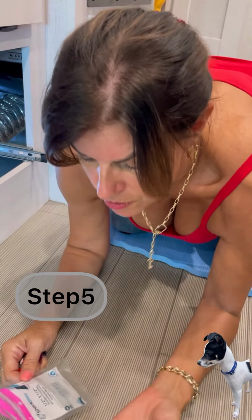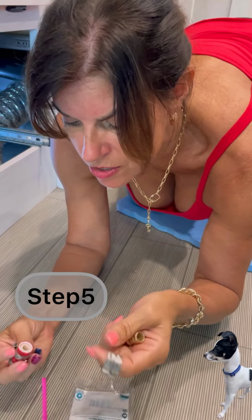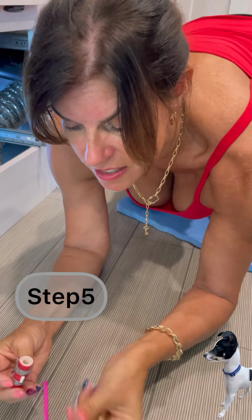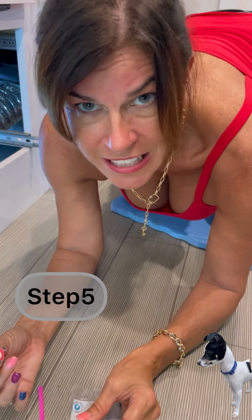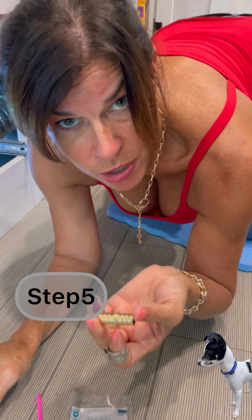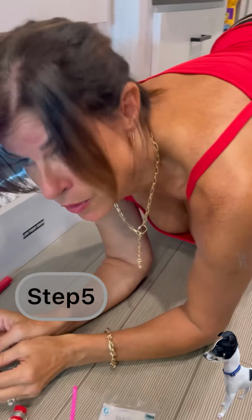So I'm going to use a genuine Shark Bite metal coupling, and they use the shoddy plastic coupling here, and it did not snug up against the materials to create a really tight seal. So what we're going to do now is use the actual Shark Bite and the actual PEX tubing and put the couplings on. So hang with me here.